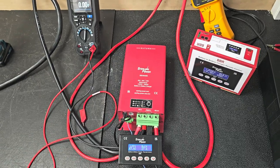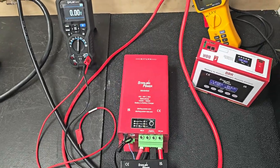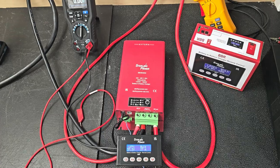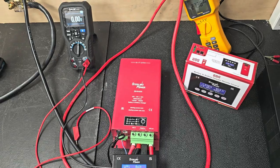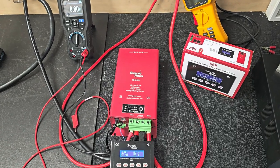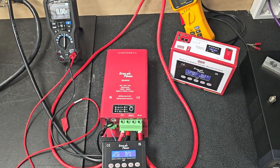This effectively limits that current — it limits the exchange to a known current value of about 30-odd amps, which should be well within the rating of most battery management systems at 48V, whether that's 15-string or 16-string. So it effectively allows you to connect a fully charged 48V or 51.2V battery to a recipient 48V or 51.2V lithium iron phosphate battery and charge one up by the other.